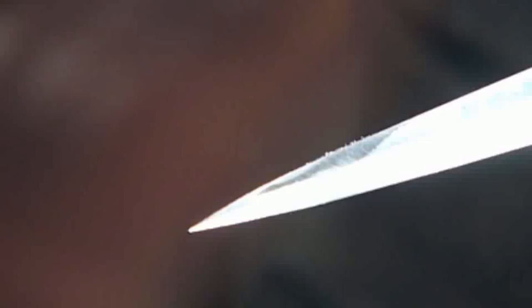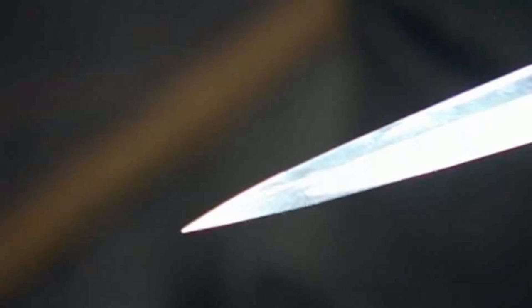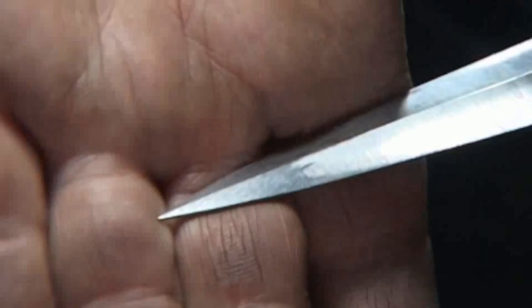And then after hardening, you would take a stone, literally a sharpening stone, a carborundum stone, and you would file your steel with a stone and then progress on with your hand polishing. You would hand polish the very tip with a flat stick and the rest of the hollow with the formed polishing sanding block, whether it's a hard rubber or a wood. And where the hollow meets the flat, you just blend it and you're not going to see a transition. Can the camera get that? I see. So that comes nicely out to the point.